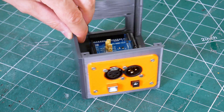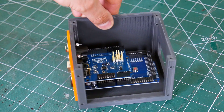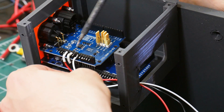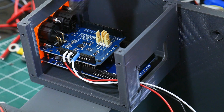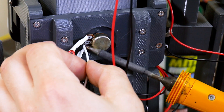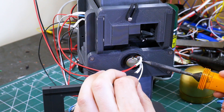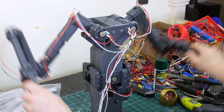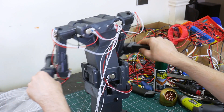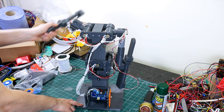The puppet is equipped with an Arduino Mega and a DMX shield I got on eBay. The Mega has lots of analogue inputs and four serial ports, so we can write out DMX from a separate port from the USB debug port. I wired in all the analogue pots using pin strip into the shield and the Arduino, with sleeving on all the connections. Each pot has a red and black wire for five volts and zero volts, and a white wire for the analogue signal. Checking all the wires can move without pulling out while the robot moves - we seem to have the full range of motion for all of the limbs.